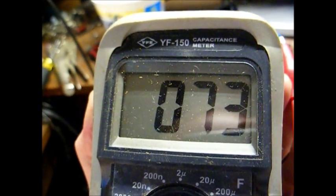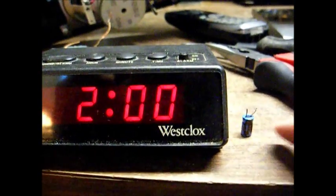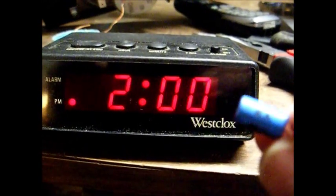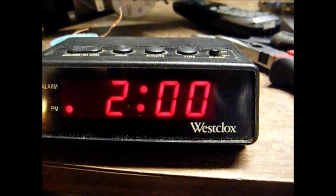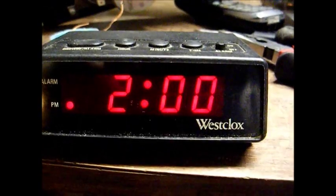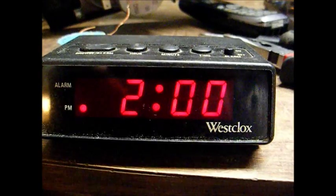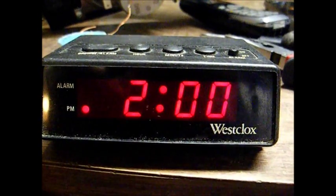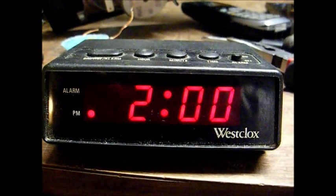So now it's time to look through my junk box and find a capacitor. It looks like this electrolytic capacitor was the problem. I replaced it with a 220 microfarad cap from my junk box, and the clock now seems to be keeping good time, and it's not making an internal buzzing sound. Another piece of cheap electronics saved from the landfill — most people would have just thrown something like this away, since it probably cost less than 10 bucks when it was new.